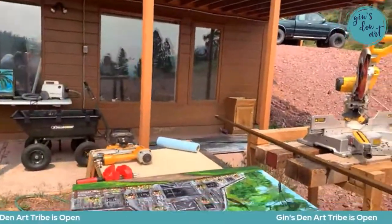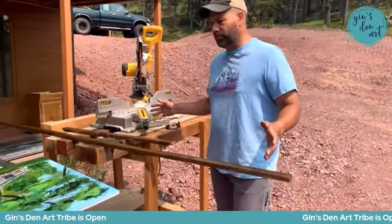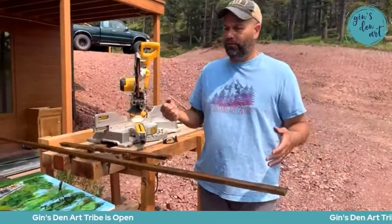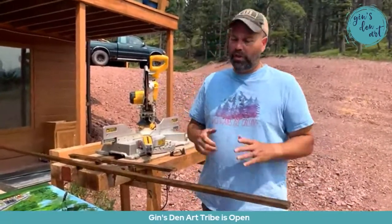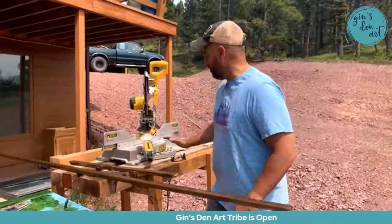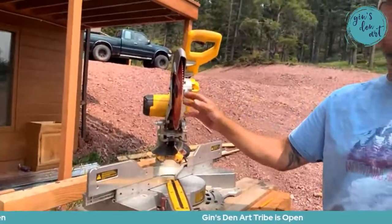You want to tell them what supplies you're using for this? Yes. I'm fortunate enough to have a multitude of supplies to make the job easier when I'm framing. But if you want to go bare basics, you buy a hand miter saw from a hardware store, and you literally cut your angles. This would be a 45 degree angle. However, some canvases, depending upon the quality, are not exactly a 45 degree angle. I have a miter saw, or a chop saw, with a fine blade on it. It didn't come with a fine blade. It came with a thick carpenter blade, but this is a fine blade.